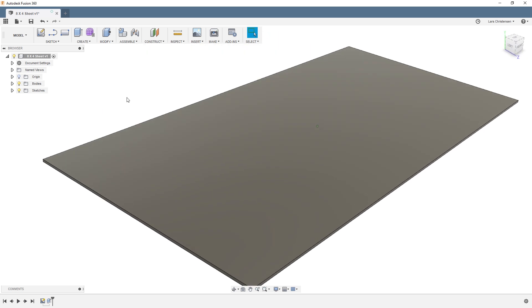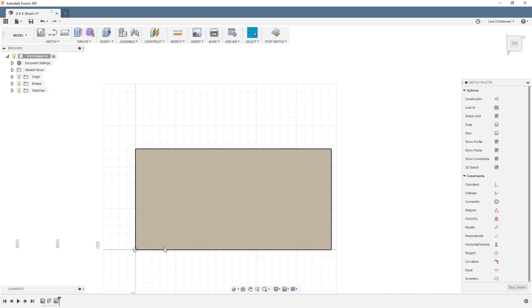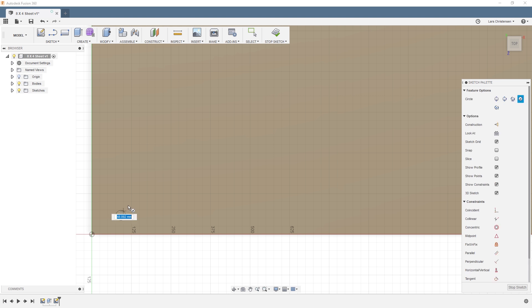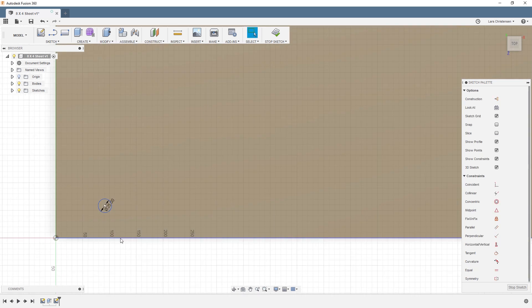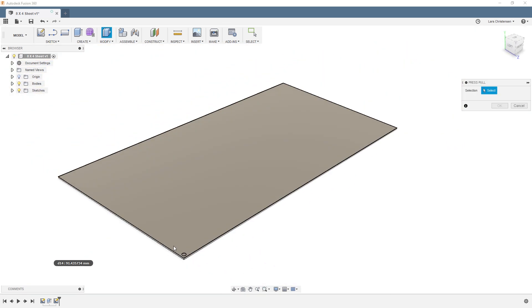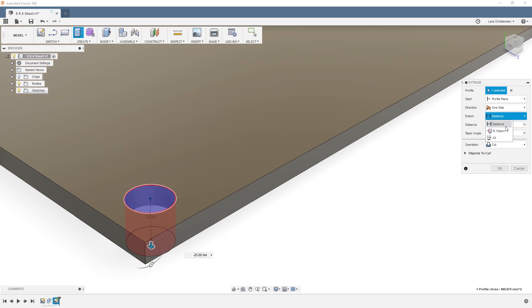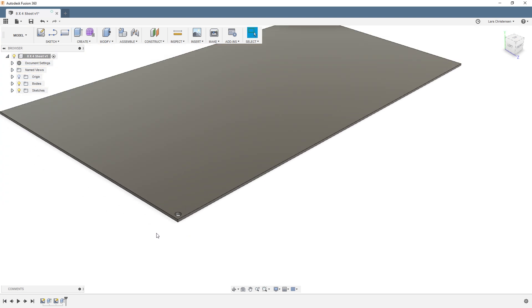I've modeled up a big sheet here. One way to do this is to open a sketch and start drawing holes, but I'm a little bit lazy when it comes to CAD and CAM. So let's just make a small circle, place it from this edge, and then hit Q for press/pull and blast this hole through.